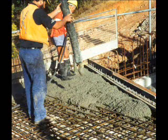This picture shows the teamwork required when pouring concrete through a concrete pump into the steel reinforcement on a cast in situ deck. Note the team member in the red vest using a concrete vibrating needle to achieve the desired compaction of the concrete.